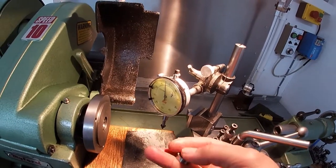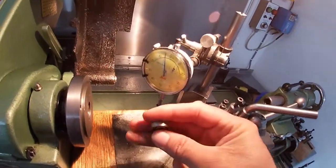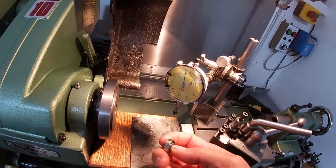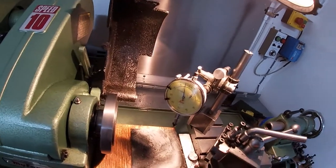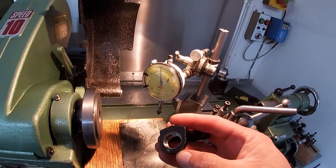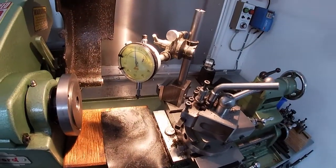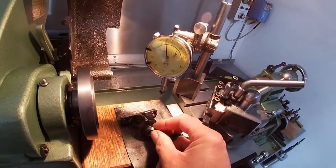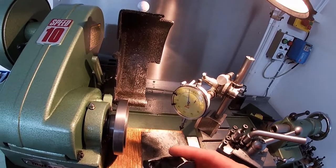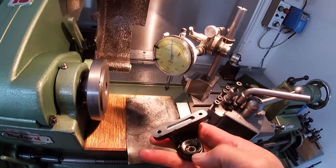These are the sort of bearings I'm using. I could have gone for sealed bearings but I got some open-frame ones — these are ones I bought at a trade show that were second hand, and I've used them just to test the process out. So that's a quarter inch — 250 thou — on the inside, 750 thou on the outside, and 5.5 mm thick. You can see in there I've actually got a lip machined in where the bearing will go in and rest. Hopefully that should drop in there — so you can see that bearing has gone in and is flushed now.